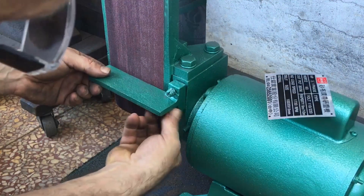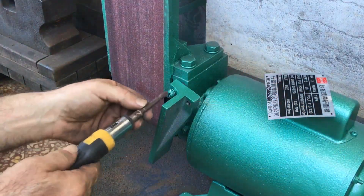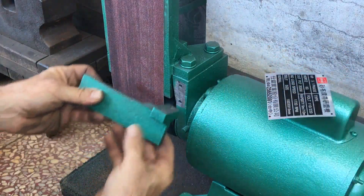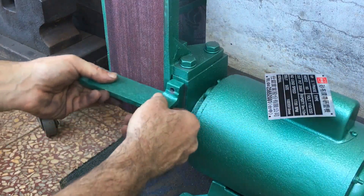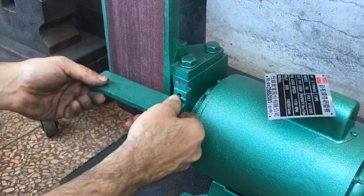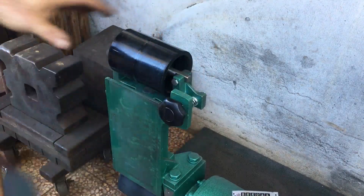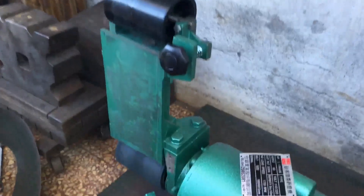I also don't like when they spray paint — or maybe this is powder coating — over everything. These screws are really cheap; the engraver's machine is much more high quality. I thought that was a spring on the top one there but it's just three spring washers together. I can see with my eyes that where the table attaches is not 90 degrees — I'll probably have to use this belt sander to sand that flat. The irony. The top tracking wheel is plastic, which is pretty cheesy to me, and the platen has been spray painted over, so that's also pure cheese.